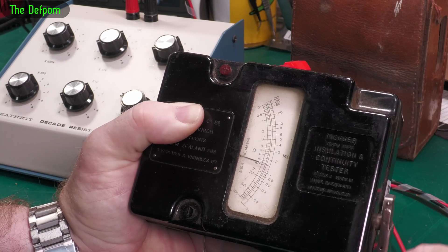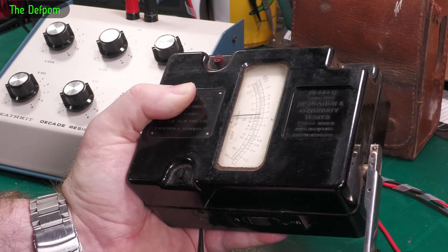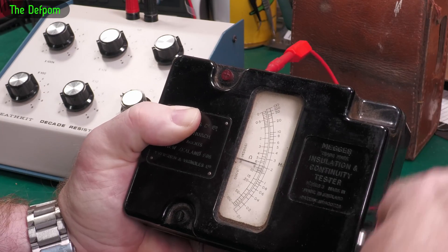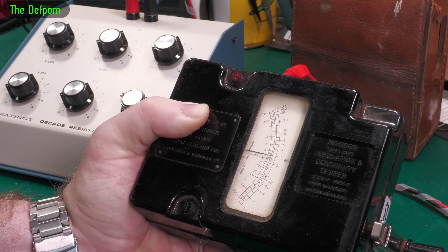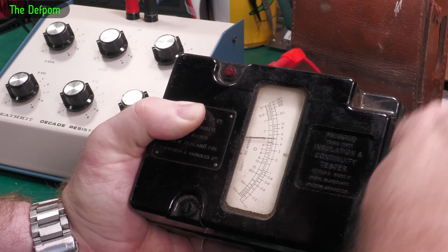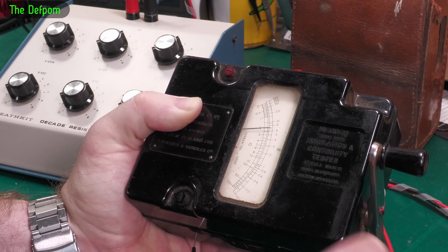Now doing 2 ohms — we're seeing 10. That's about 8 ohms out. These connections may not be the best for this particular connection, that's part of it. But I've seen about 8 there. I'm going to set to 2, so it's about 6 ohms out. I'll set that as a dead short — you're seeing about 3 ohms. But it is actually working.